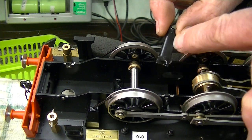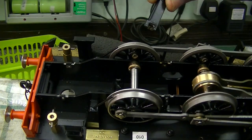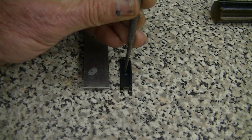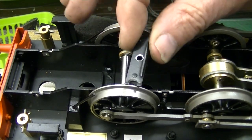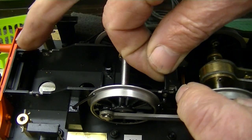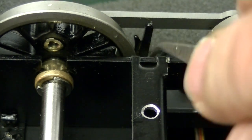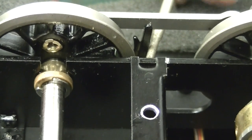The reason we're removing this one is so I've got to drill a hole in the center of it to support the bracket which holds the switches. Mark off the exact center spot, give it a ding, then drill it with a three millimeter hole. After drilling the hole we pop it back with the turned edge facing forwards, using the tweezers in reverse — and in it goes, both sides.